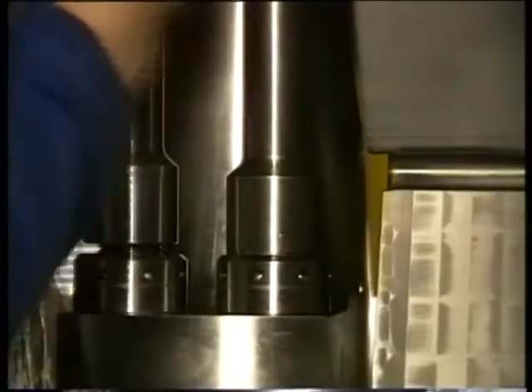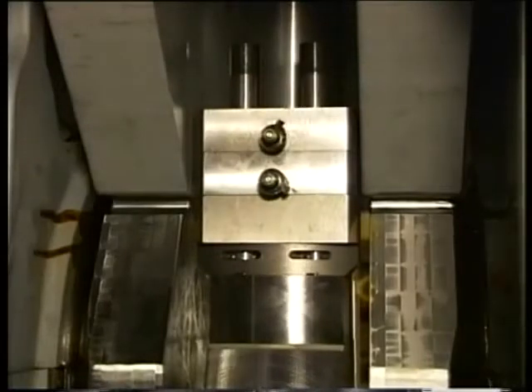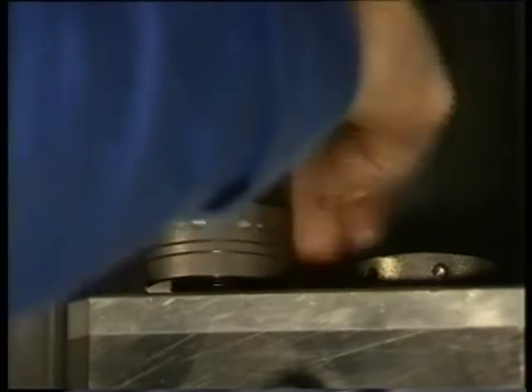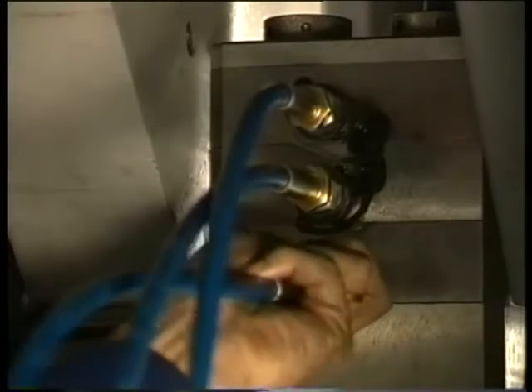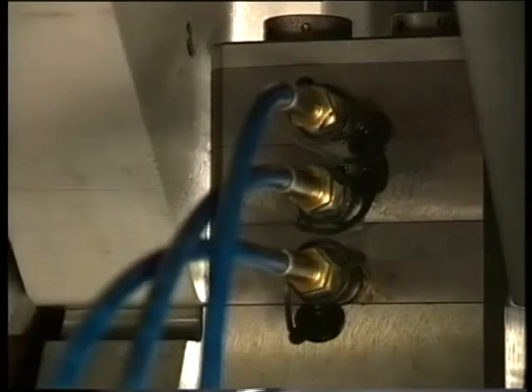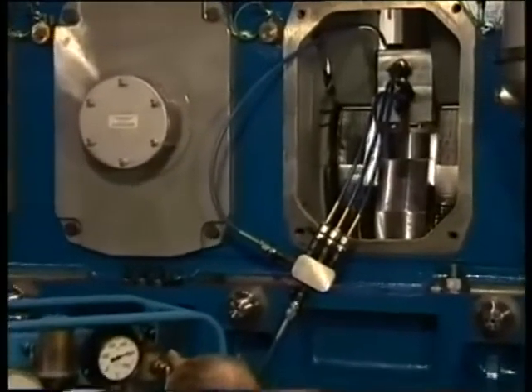Now provide the jacks on either side of the connecting rod foot. Disconnect the pin and remove the pipe. After the jacks have been connected to the pump, re-tighten the nuts of the jacks with the hook spanner to bring the jacks in the bottom-most position. Connect the second set of jacks using an oil distributing block and subsequently fully pressurize the jacks simultaneously.